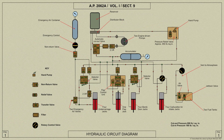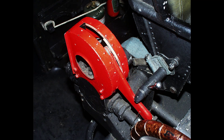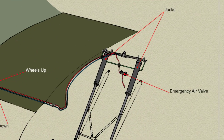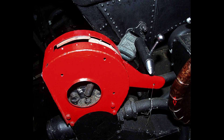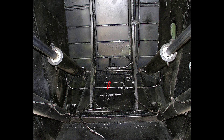Here's the circuit diagram of the whole hydraulic system. The raising and lowering of the main wheels are governed by the hand operation of a selector valve on the right of the pilot's seat. This is always in either the up or down position — there is no neutral. When the selector lever is moved to the up position, fluid is delivered through the non-return valve and selector valve to the underside of the jack pistons and raises the main wheel units. When moved to the down position, the fluid is fed to the top side of the jack pistons via an emergency air transfer valve carried on a stay between each pair of jacks.